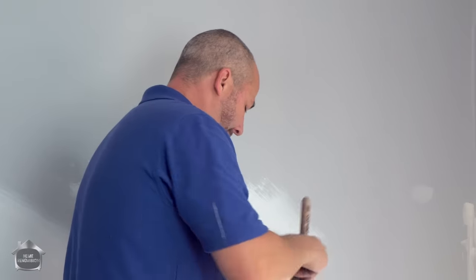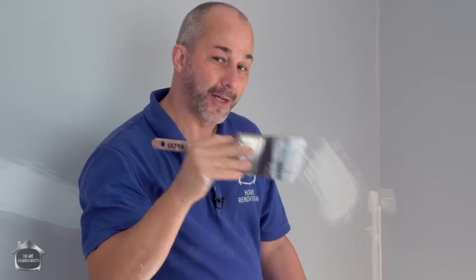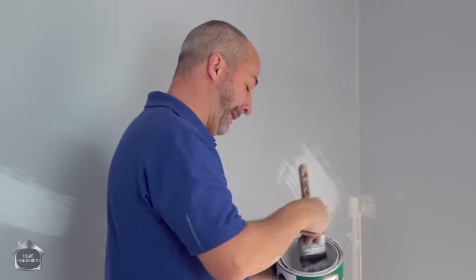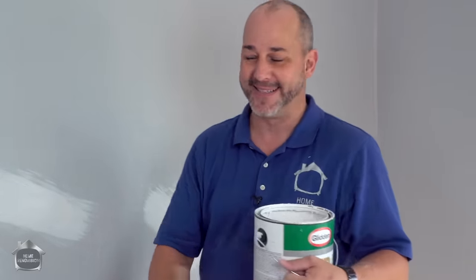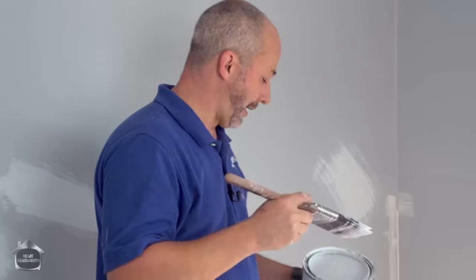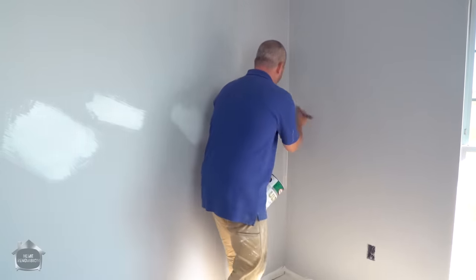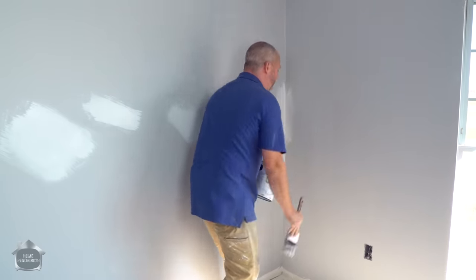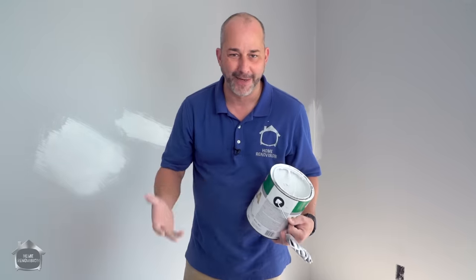The purpose of this is to make sure that if you're using regular compound, these little spots don't end up showing through in the sunlight. This is called flashing — and flashing is the painter's enemy. Whenever you have flashing after two coats of finished paint, you can't just go along with a brush and touch it up, because that'll show brush marks instead of roller marks. With acrylic paint, the levels dry differently from beginning to end, so the only way to make a nice wall is to paint the whole wall top to bottom, the whole section. Better safe than sorry — hit it with your primer and you can avoid that costly mistake. Flashing will leave you really disappointed, and it means buying another gallon of paint to fix the wall, since most rooms one gallon is just fine but flashing means you won't have enough left to redo it.